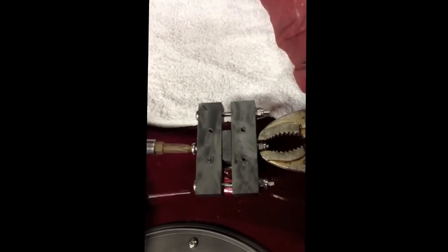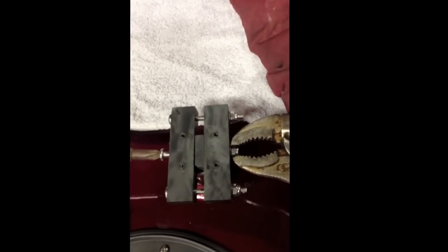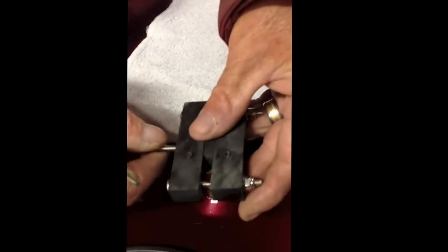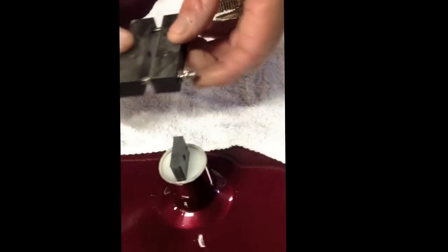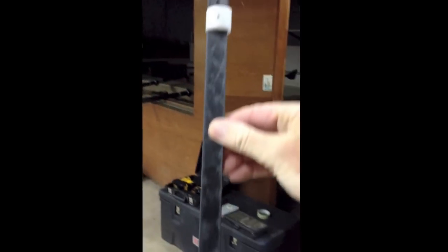As you can see, the two end ones are loose and we're taking the middle one out. The middle one goes through the rudder post, and there's a hole in that. So we're going to undo that, pull that all the way up, drop all the little things as everybody always does, and that should slide right off the top. There we go. You can see here's the very top of the rudder post — I'm going to slide that down — and this should come right out. And there we have our regular rudder has come out.